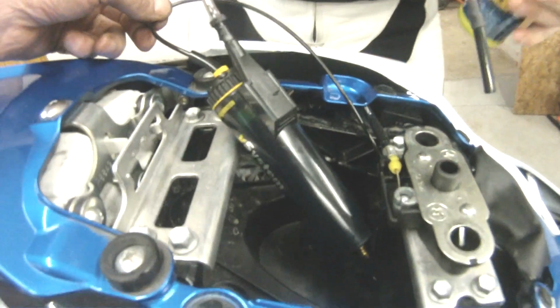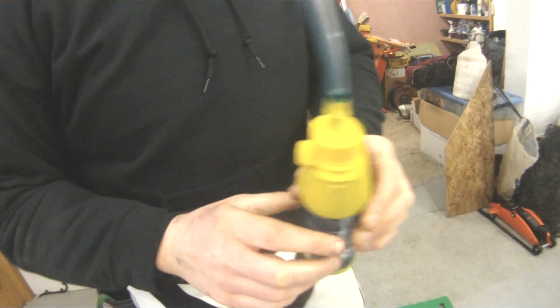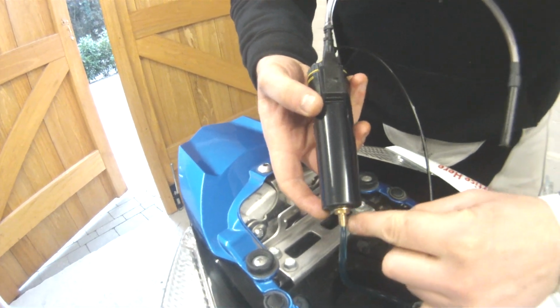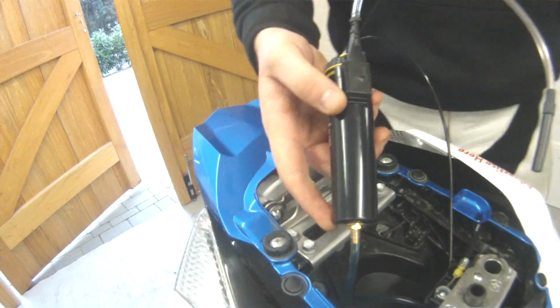You just pull that off there, take this tube, that's your oil, bog standard oil. With the end there, make sure you cut the nib off, which Ian forgot, I had to point that out. So you cut that off, shove that in there, squeeze, that fills up the reservoir. So that's all nice and filled with oil. Then the next part, this is the bit that works the muscles, you've then got to prime it and force all that oil all the way from here right down to the dispensing nib.